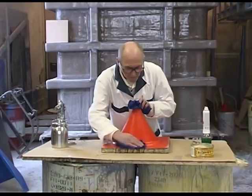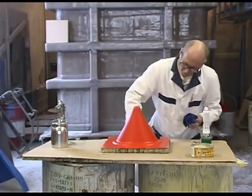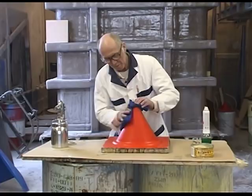An important thing to remember here is just don't use any old rags. One of the little catches that may surprise you someday is you'll get a rag that you may have used with buffing compound. Well, buffing compound never comes out of the rag, and as a result it'll embed itself in, and all it will do is scratch through the wax surface that you've just put on. Then when you put the wax on later, you'll have the privilege of having a very difficult time getting your mold and your gel coat to separate. Usually they come apart in pieces.